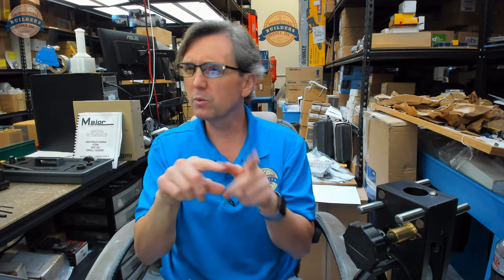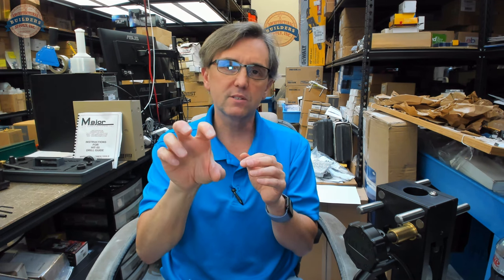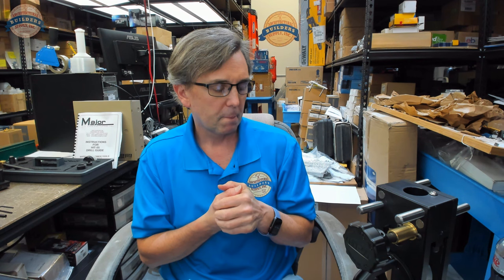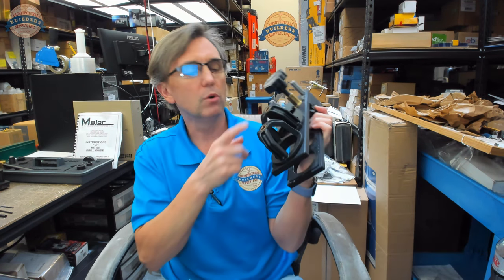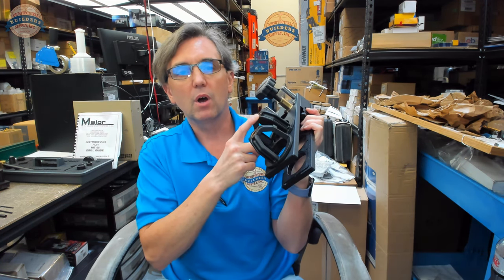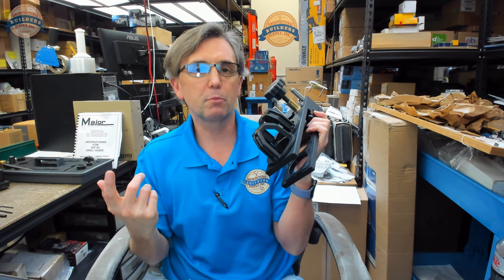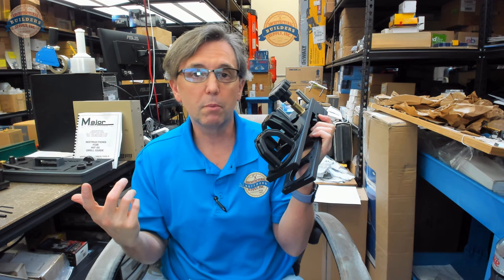Oh, Baldwin, too. Baldwin is like 1.625 inch. I wish it was 1.5 inch. Baldwin has a smaller profile, shorter projection, cleaner looking deadbolts, smaller holes generally. Take advantage of those smaller holes. You may not be able to use your tool, well, you could still use it. I mean, you're going to use a hole saw, unless you can find a multi-spur bit that's 1.625 inch, if you're doing Baldwin.